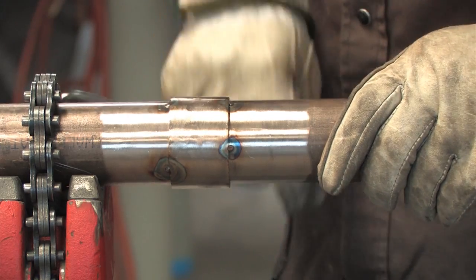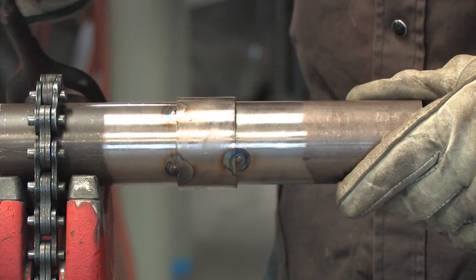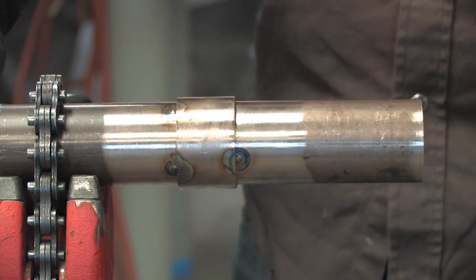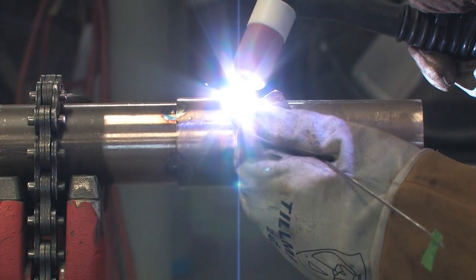All weld bands shall be inspected for proper fit up prior to being welded out. Weld bands must be inspected and signed off by either a work leaderman or foreman. Any weld band that does not have a badge number for fit-up shall not be welded.